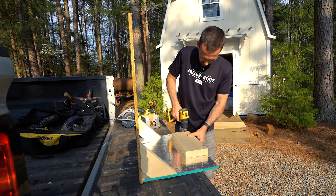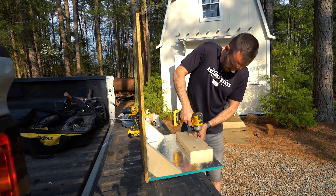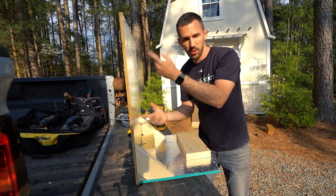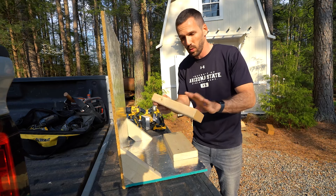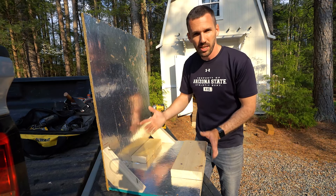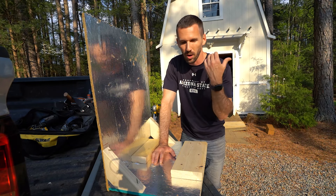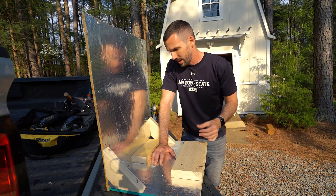Since I don't care how this is going to look because I'm going to throw it away after this project, I don't care if there are screws sticking out — I'm going to take it all apart. This is already pretty sturdy; I can barely flex it as is. The weight is going to be deferred onto two points, two steps, two legs on the ladder. I also have another piece of 2x4 to add in the corner as an angle support. You can do even more if your stairs are higher up, or buy metal brackets for three or four dollars and really beef this thing up.